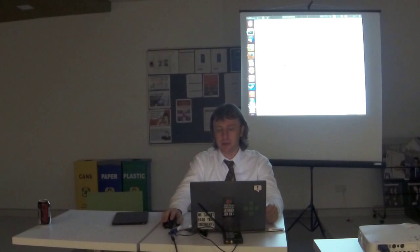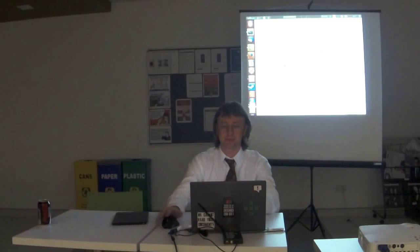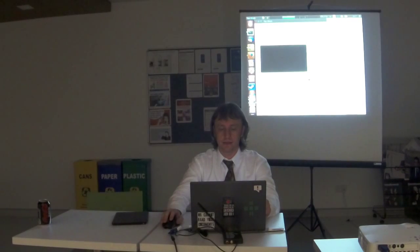Now, after automatic gain control, I put just two things. First is the waterfall sink, and the second is the FFT sink. Both are graphical visualizations of the spectrum. And if I run it now, I can see that here it probably needs auto-scaling. Yeah, there is some artifact in the middle of the spectrum, but otherwise it's pretty much empty.